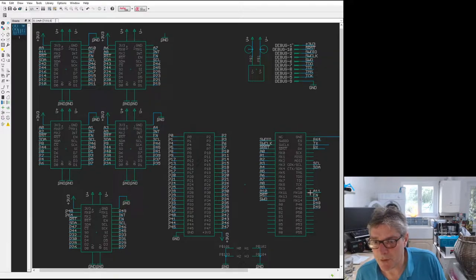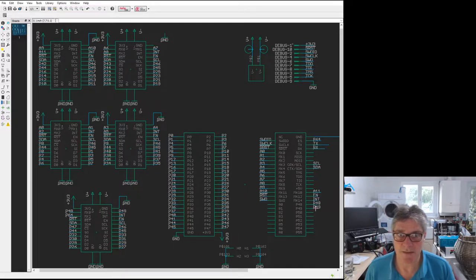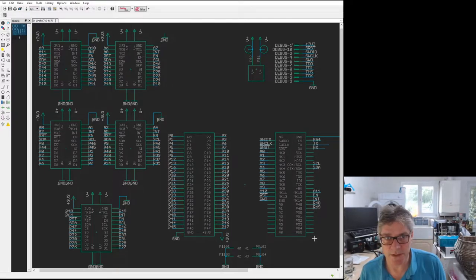Perhaps we should then mention what we're not using. So the rest of these 8 bits we're not using. So there's another 6 bits here that we're not using. Those are actually connected to the SD card on the FPGA. So I'm trying to avoid using those. It's possible that we could wire them. I'll come back around to that in a minute. So in the cases where you're not using the SD card, you could reuse them. And then we have some reserve pins here as well.